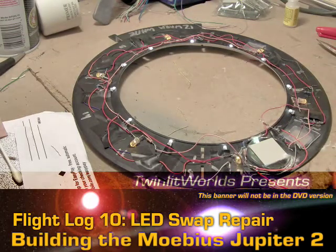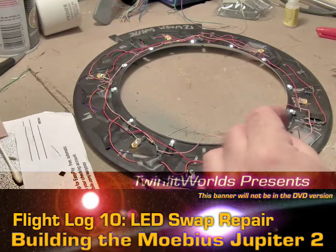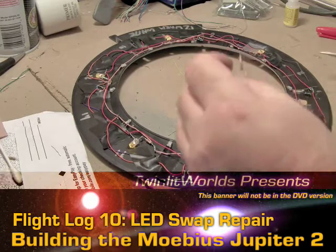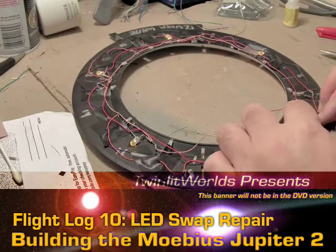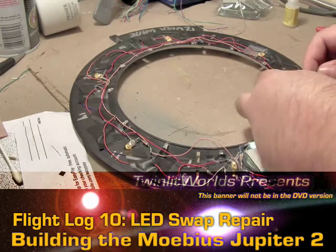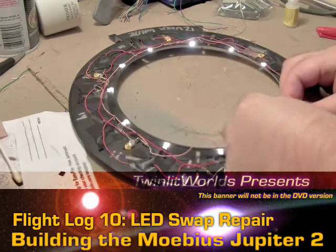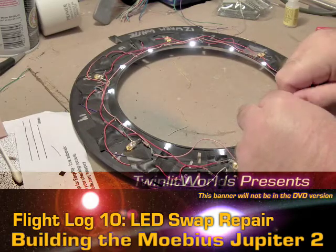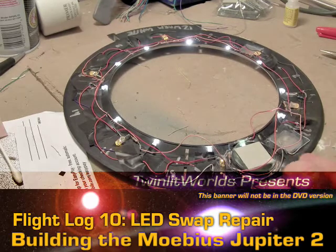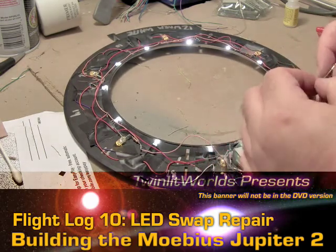So let's clean this up a little — the resistor should still be good but I'm going to pull that out of there anyway. Let's trim this one. You'll notice that cut the power to everywhere. Trim that one. Just use your fingernail to pull a little bit of insulation off of there, and tie these two together. You'll see the power is restored to everywhere, and that's because this negative leg is what's powering that. So we'll now take this resistor and wire this in.